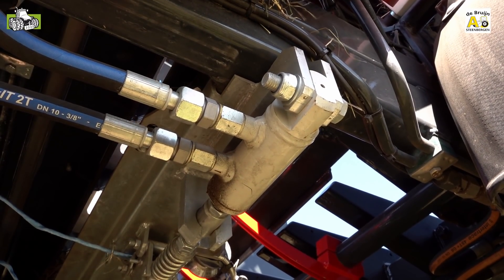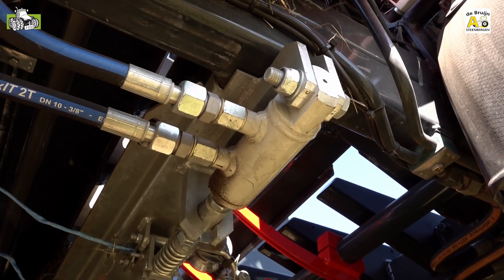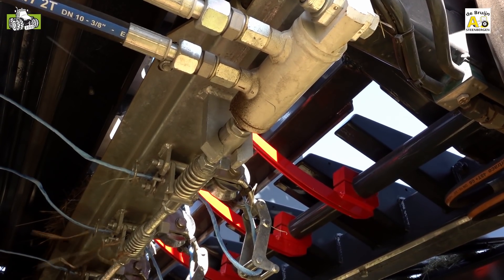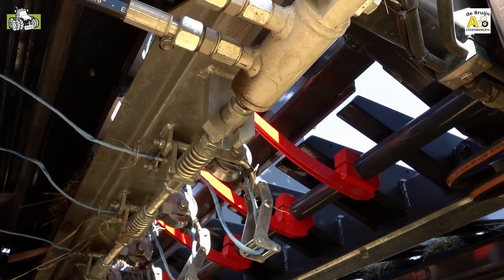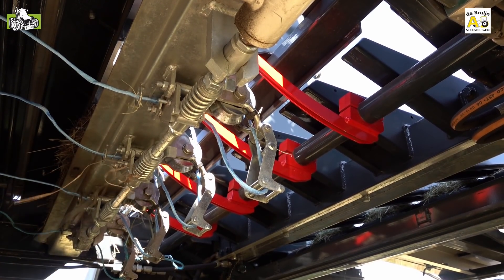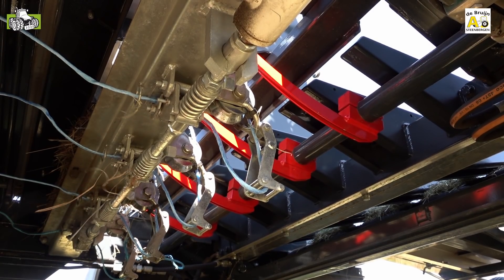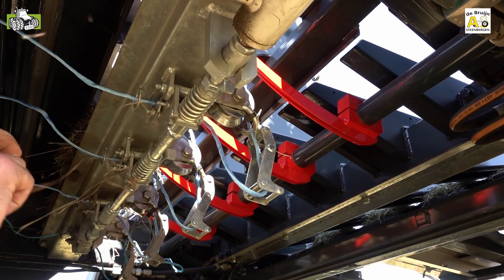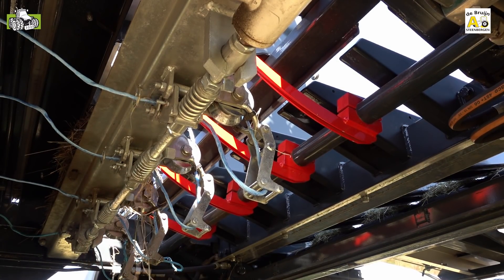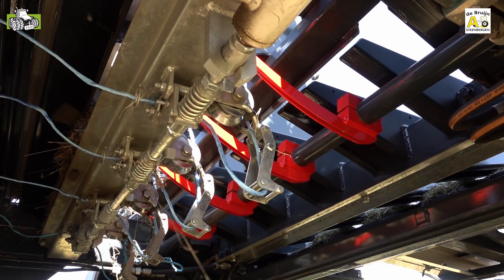There is a small hydraulic cylinder. When the press carriage moves upward, the twine clamp closes here and you get a high feed tension on the twine. When the machine then starts knotting, the needles pull together the first twine slack that has formed around the package, and then pull the remaining length needed to form the package from the twine spools. When the press carriage moves down, the clamp opens automatically so there is no twine tension when a bale is fed in — otherwise you would have to push the bales against the twine tension, which would not work.